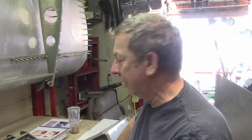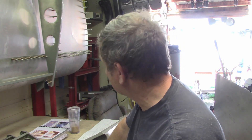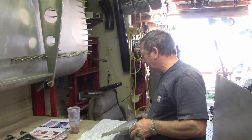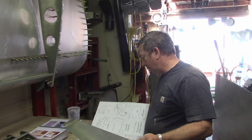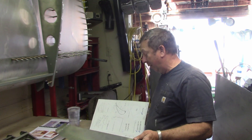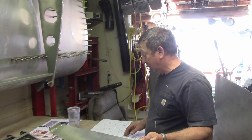I've been going through and assessing what material I still have here in stock. I've still got a little bit of 16 thou — not enough to do any skins. I'm going to need to finish out wings anyway. On the 25 thou, I had a fairly nice-looking four-foot-wide piece here in the shop. For this outboard spar I needed 1790mm, and the length of this sheet is 1773 — I'm 17 millimeters short. We'll order some 25 thou; I think I need some for other stuff anyway, so not a big deal.